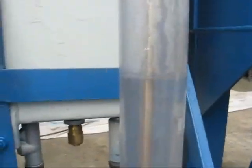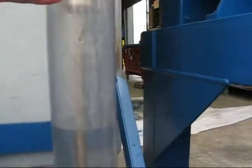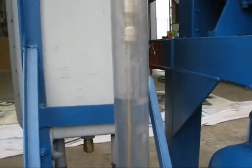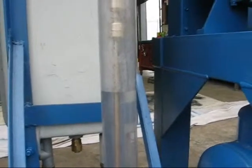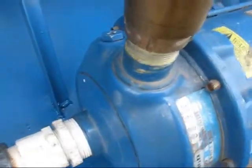You can see the water level rising. Once it gets up to this level, the pump should turn on. We're going to have to prime the pump — basically, this screw on the pump right here has to be loosened to let the air out of the pump.